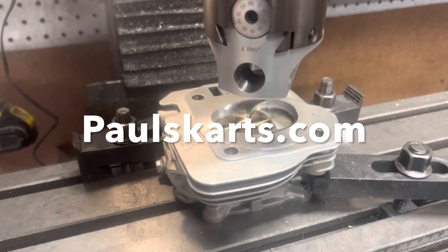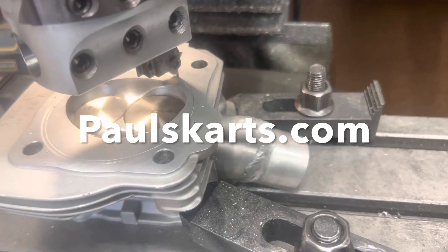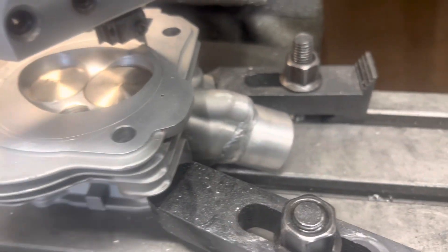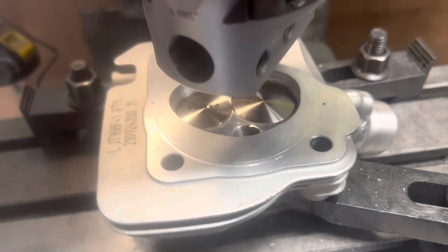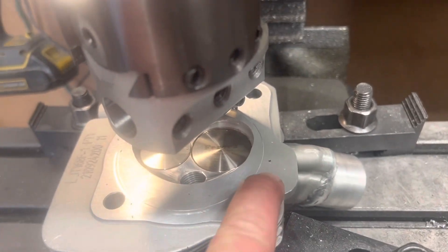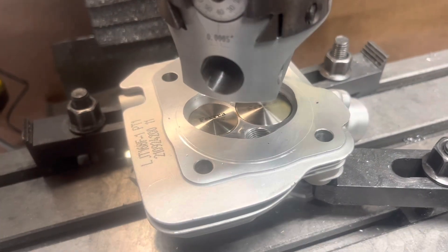We've got in the middle here a big valve head that we did with titanium air valves, copper seats welded into a tube, epoxy port, upgraded spring package, and this one actually has the solid slug welded into the tube. It's pretty much all the features you can get.